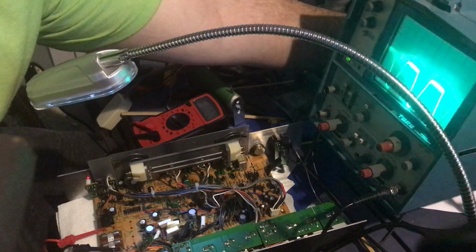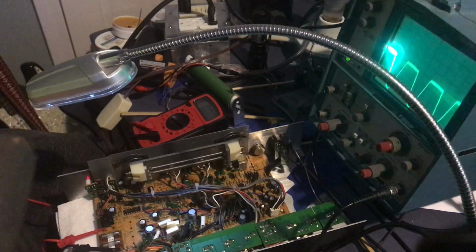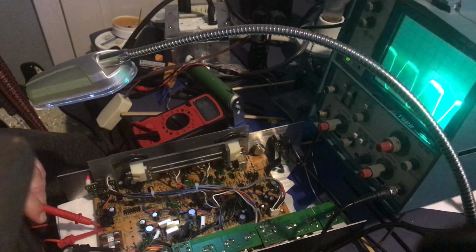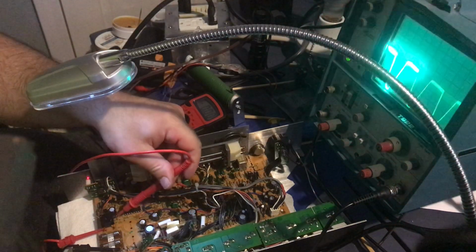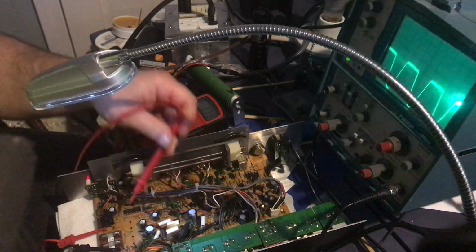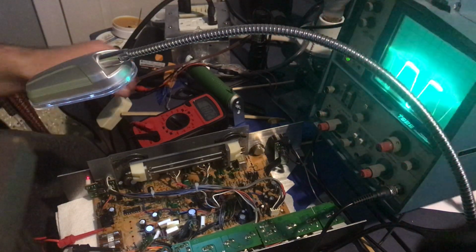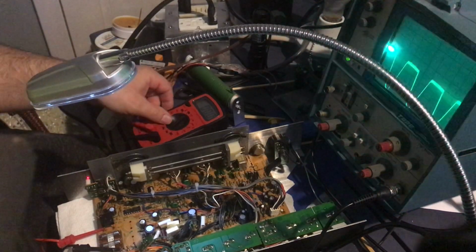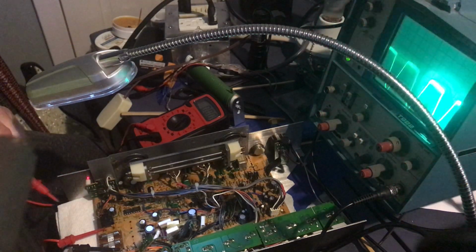Let me dial up the voltage a little more. Let's see, I got negative 9 volts there. Positive 13.8 volts. All right, let's put this in AC, because I was recommending you shouldn't probe it in DC because there's still a signal going up and down, and only probe it in DC once I put the filter caps back in.